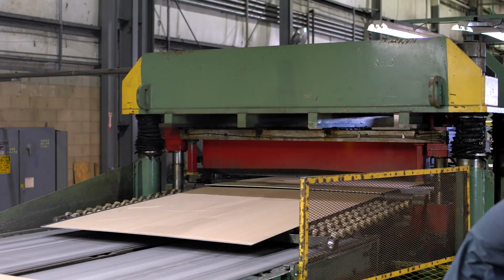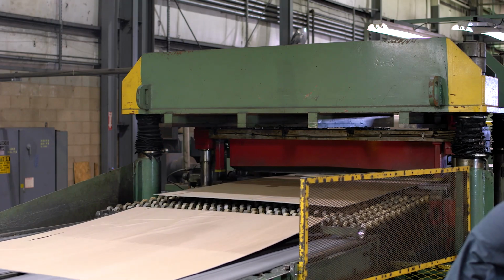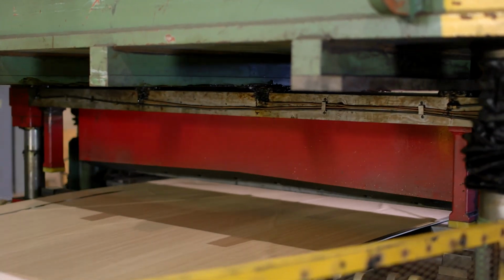The first machine is a flying die shear machine. This simply means that the shear travels with the metal to position itself for the actual cut. This line is known inside the location as CTL1.